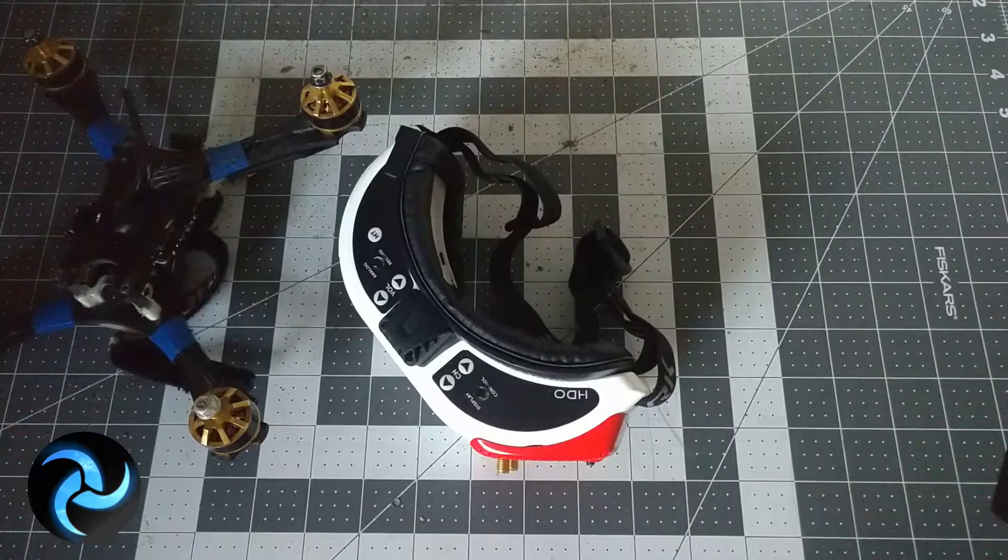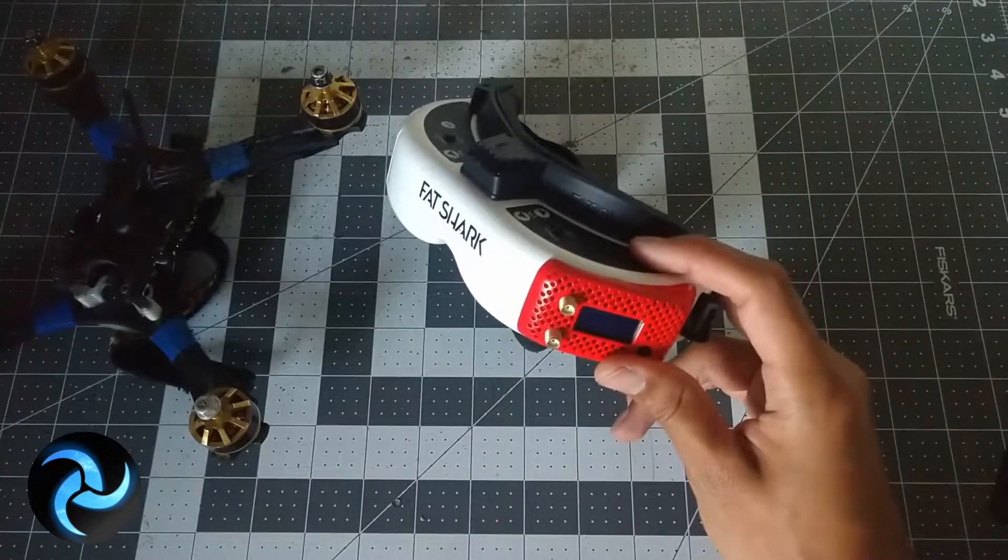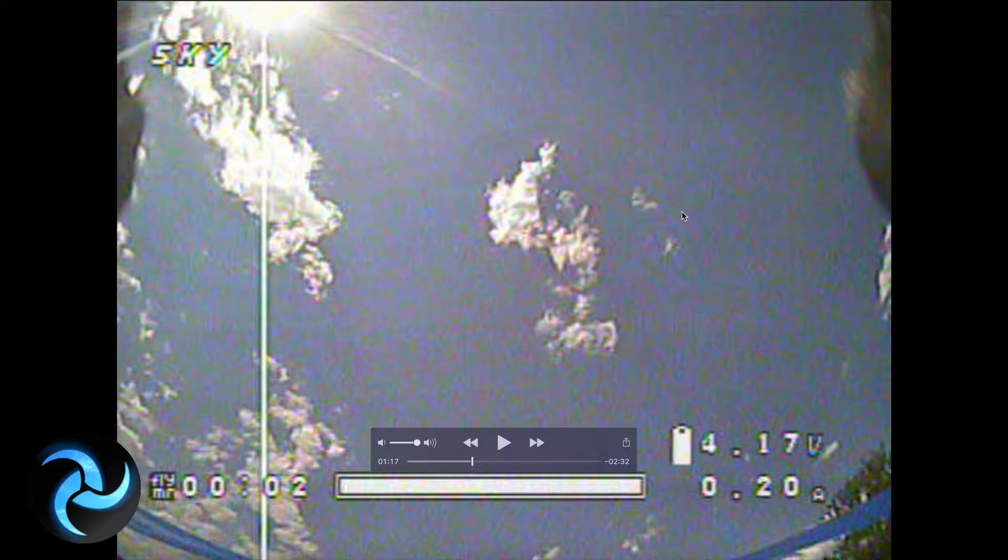It does get a sync back, but by that point it's too late. This was my first experience and I was pretty upset. So I started browsing Facebook and got onto the ImmersionRC community page, and they had a firmware version you could update and test — I'll have a link to that below in the description. I got the new firmware on there, and they basically added a new mode. I think they're going to call it compatibility mode, and it tries to work better on cameras and OSDs that are out of spec and poorly filtered.